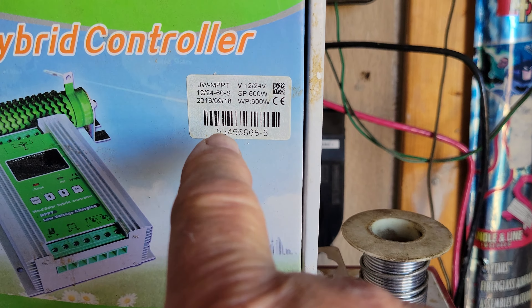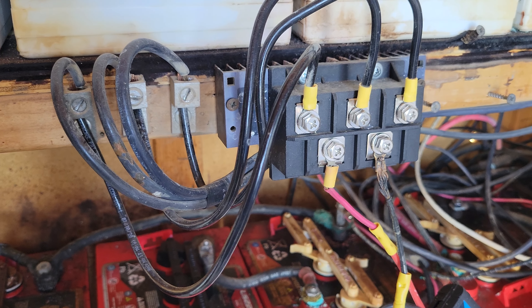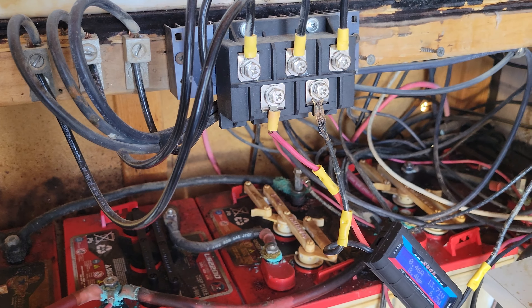Let's get back to Paul's dilemma. If you have a hydro that provides AC — like a wind turbine or a PMA, which is a permanent magnet alternator — and it has three wires coming in, then you have to go through a bridge rectifier. These are the three inputs on the top, and then it converts it to DC with one positive and one negative coming out. Don't worry about that burn there — that was from another episode. The wire still works, so I didn't change it yet.